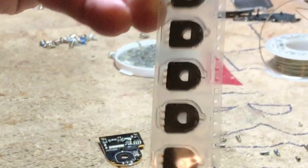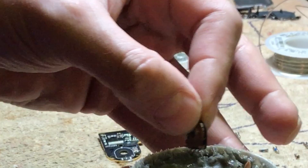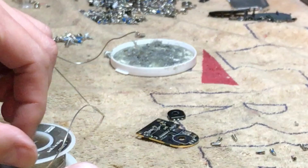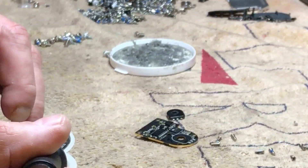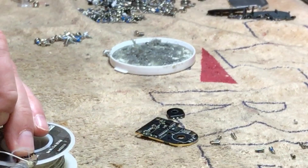I found the new potentiometers — they look like this. When you order a lot of them they usually come in a package. I'm gonna grab one, dunk the connectors in the flux, and apply a little bit of solder. Usually when I apply solder to something like that, I try to have it elevated, then just apply a tiny little bit. Same thing on the other connector.